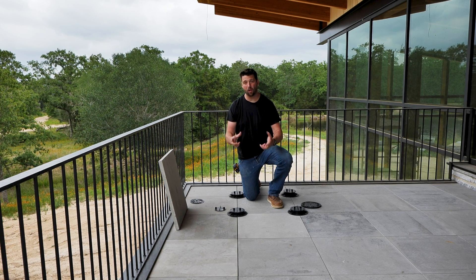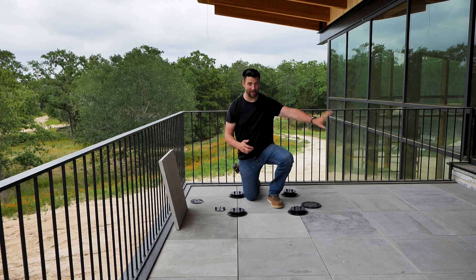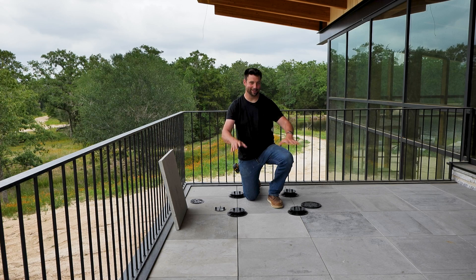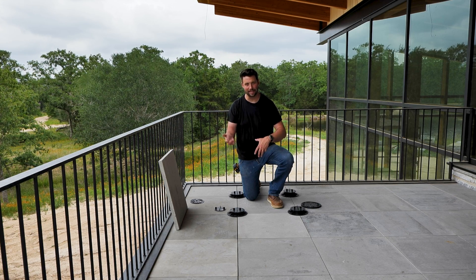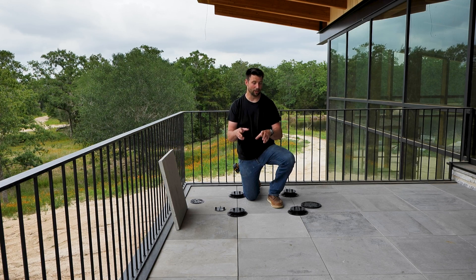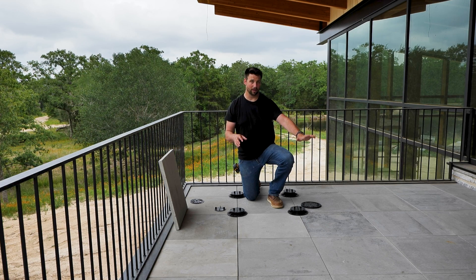Then we made sure that we did all of our flashing right. We did metal flashing and we zip fluid-applied that back up to the zip. We also did a sealant on the flashing back down to our Advantec, and then this whole thing was red-guarded. We were a little bit concerned about the TPO adhesive sticking to it, but we ran that through our roofing manufacturers and they said that should be fine. Check with your manufacturers to make sure if you're trying to copy this. We did stainless steel metal flashings from the wall to the decking.